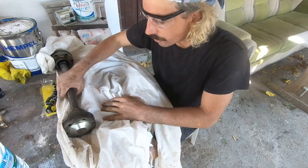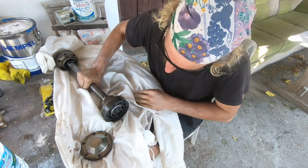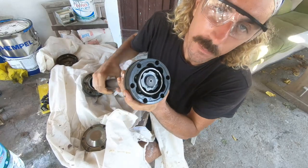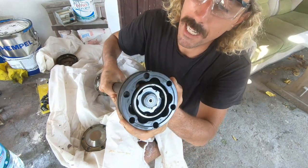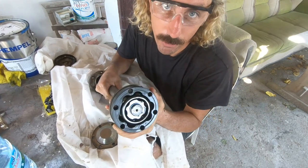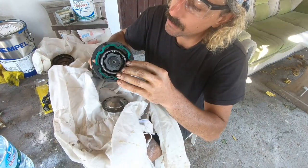Now I've spent a bit of time with some grease remover, brake cleaner, to clean up this coupling link that connects the engine to the thrust bearing. And if you look inside, for example this one, it's nice and shiny. It's a pretty great mechanical thing. It's got these balls in there which allow the connection to move in this direction and in this direction, but not in the rotational direction, so that your boat has power. Pretty cool thing. Put that cap back on. Little seal.